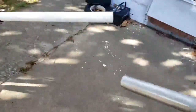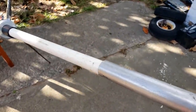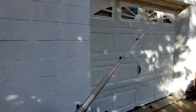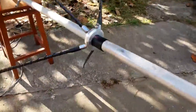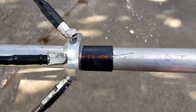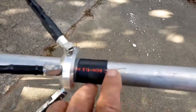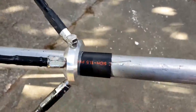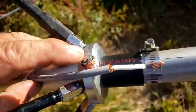Now I put my sleeve in place and grab the antenna part. We slip that over that. Now I'm going to have to slip it off one more time, put the clamp around there. I've got to just put my coax onto this — the coax shield gets put on with that nut, and the center conductor will be put on with a hose clamp. The braid went underneath that nut, which also serves as a jam nut so that bolt can't back out.